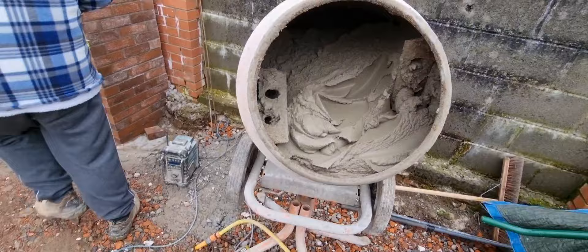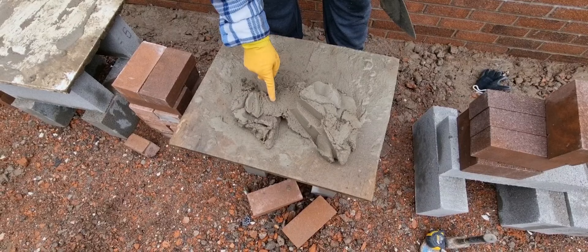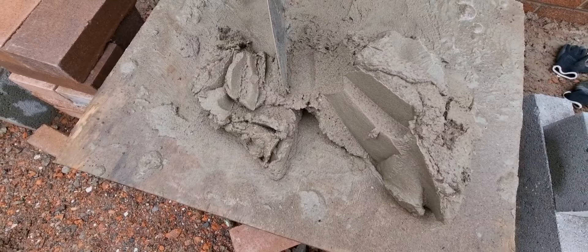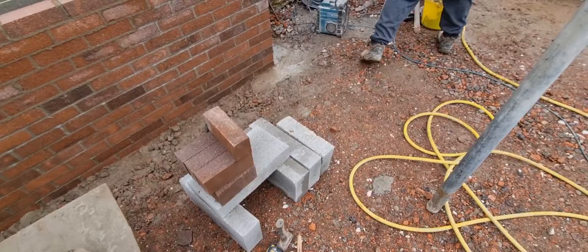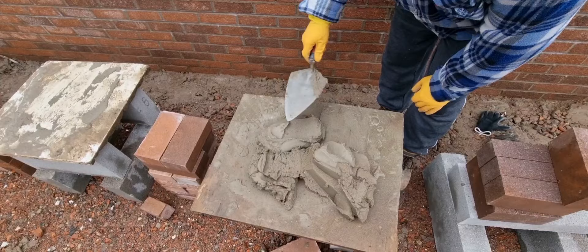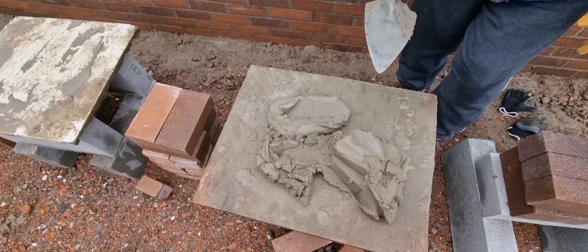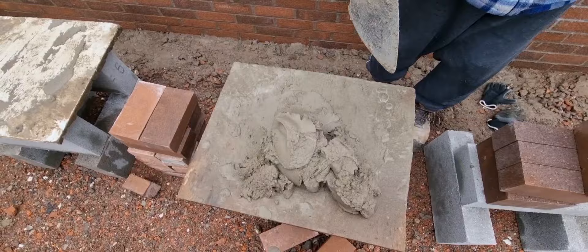This one over here has been sitting on the spot a little while, so you can see that this one is not so well mixed — you can just about see the separation, it's not holding together as one, which suggests it's not mixed as well. If I get a shovel and put that next to the other, you can see the difference between them. As I move through it you can see it's completely mixed through with no separation, whereas that one you can see the difference — and you can feel it on your trowel as well. It's all the same color, which is what we want.